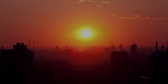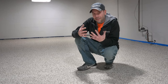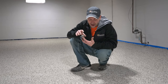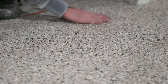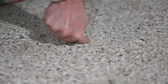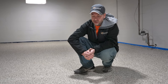We're back the next morning and the epoxy is all set up and ready for the next step. When you first arrive, go to wherever you ended the day before. Because we chipped so heavily for coverage, you can't really feel the coating under all those excess chips. The best thing to do is brush off some excess chips and push your thumb down hard on the remaining chips and try to twist — if they feel solid with no movement, you're ready. If chips are still twisting or moving, wait a couple more hours.